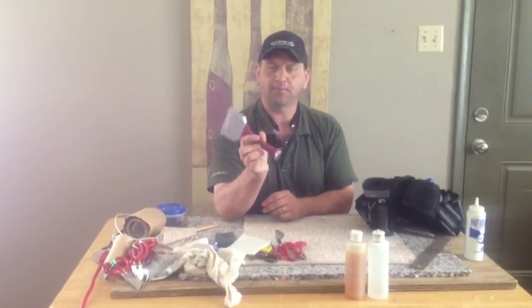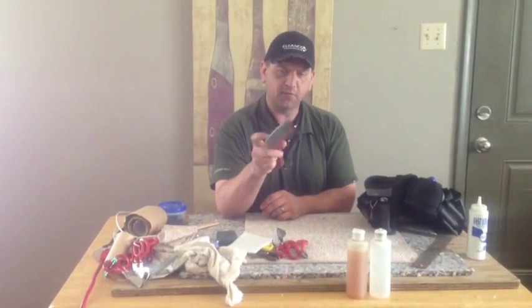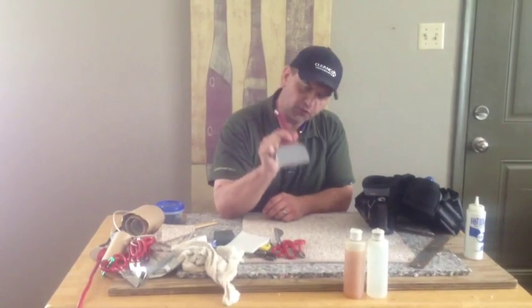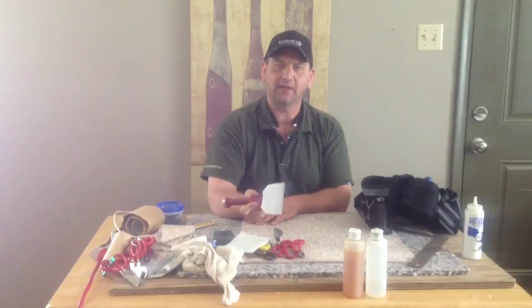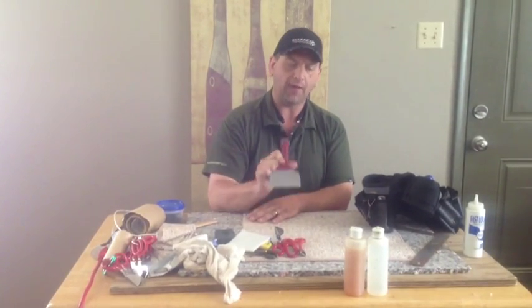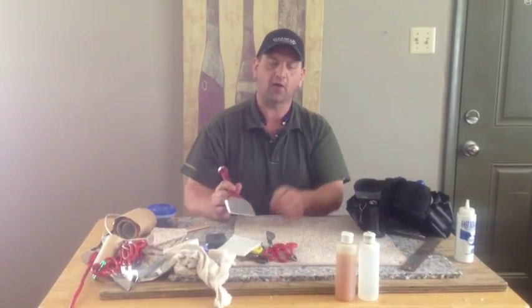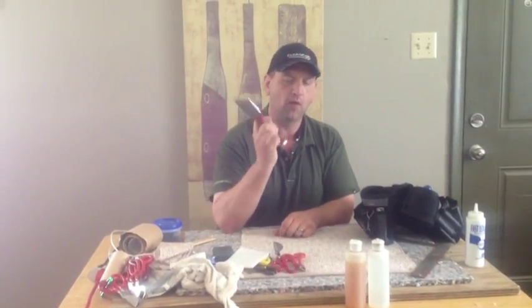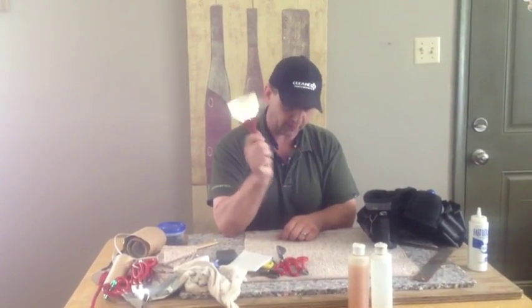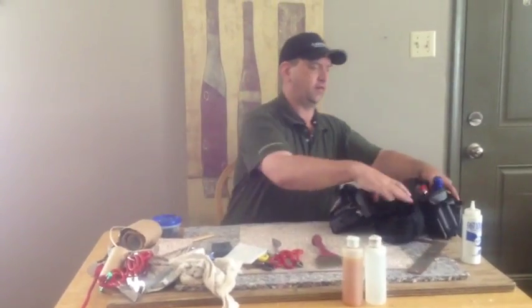Now this is sometimes called a stair tool, and this is basically a tool in which to tuck the carpet into the gully when you're doing an install or a repair, and they also use it to tuck into the crotch of the stair whenever you are installing or repairing stairs. So this is a vital tool. You must have that with you. We do a lot of re-stretches, and this is what we use to tuck during the re-stretch.